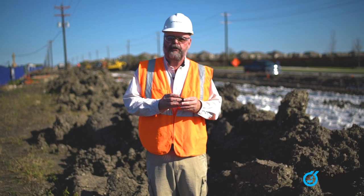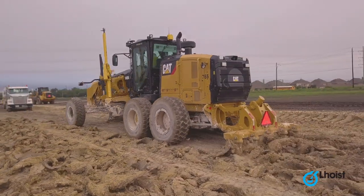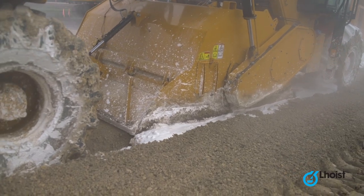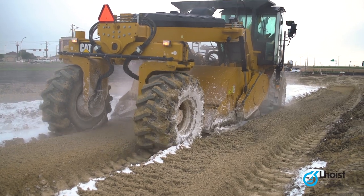You go from a deck of cards to a house of cards. So when we look at the soil, they start to open up the soil by ripping it, spread lime in there — that gets it sort of mixed — and then they come back with a mixer. As they're mixing, the lime is going across all the particles and surfaces. It's in the water, it's dissolving, it's transferring on the surface and kicking sodium out.